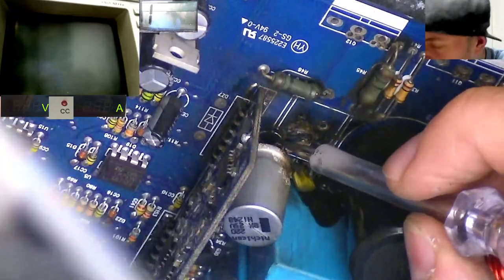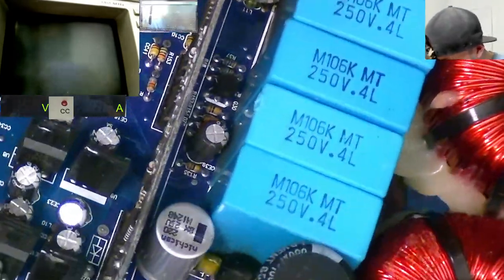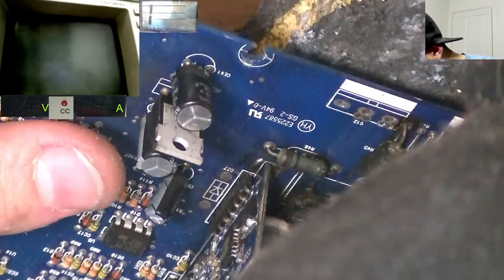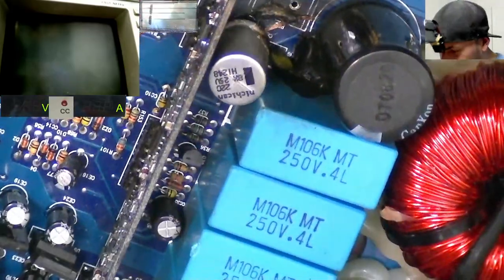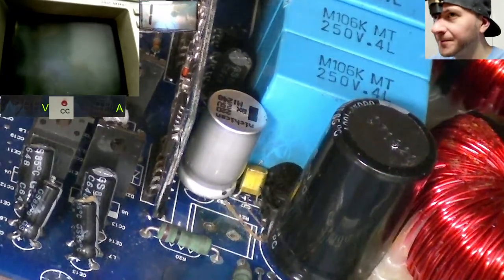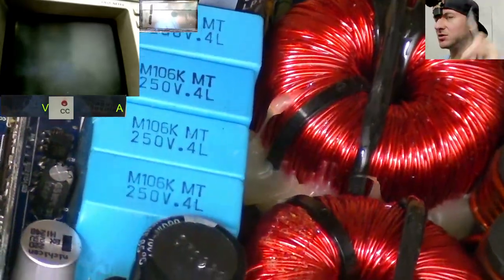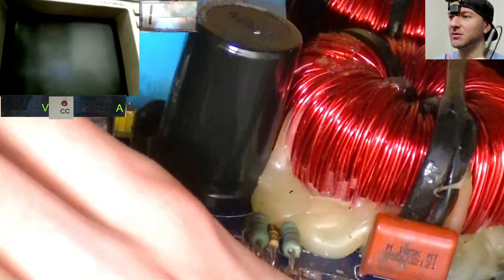Sorry for getting my head in the way. It's very difficult to see what I'm doing and film it at the same time. I did that. Where did that connect to then? Because on the other side of the board, that trace that goes under the resistor does look like it's for that cap. Doesn't really matter. We can just use a multimeter and confirm where it's supposed to connect to and just run a jumper wire somewhere else. But I just want to see where all the traces were originally supposed to be going. So